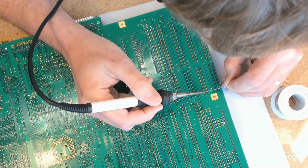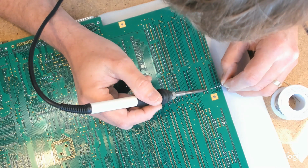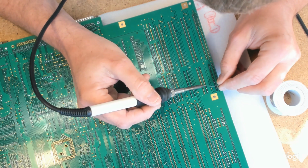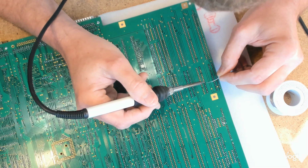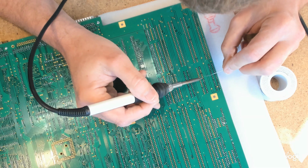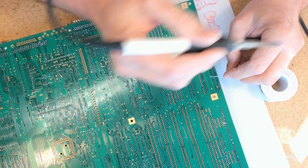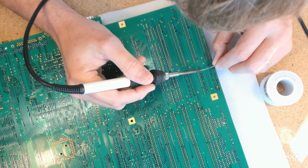These connectors are a murderous thing in some respects and just boringly easy in others. Yeah, sometimes it just, and of course the technique, you can see there that I'm not touching, well maybe you can't, but the solder's not touching the iron. The solder's touching the board. And that's its job, is to tin the board, the flux is to not get turned to smoke by the soldering iron, but to flow out of the center of the solder wire and clean the surfaces sufficiently so as to allow for the application of solder. Really had to wick that one.